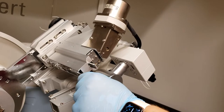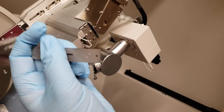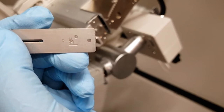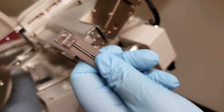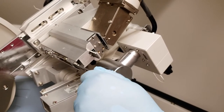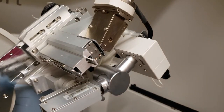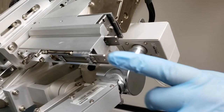We have two slits on this side. This right here is called the anti-scatter slit — our default is one-quarter degree. Again, this has two sides to it: the bumpy side and the not-bumpy side. The bumpy side again goes toward the source, so to the left. This one, when it slides in, the little click point where it stops is very, very delicate — it is very easy to scoot past it. We have just a little less than an inch sticking out, and you want to make sure that you stop at the click point. Do not push it all the way in. The last one here is the receiving slit — this one is one-eighth of a degree. Bumps go toward the source, and this one has a very stiff spot where it clicks.